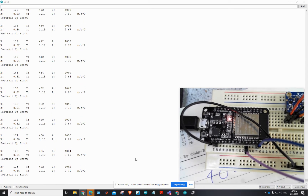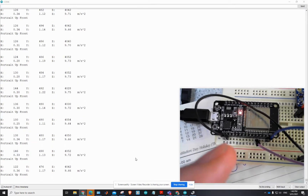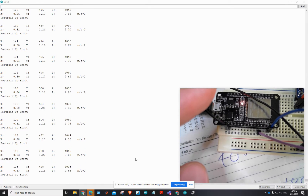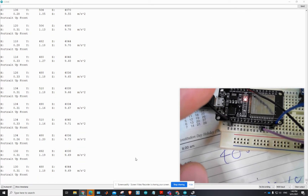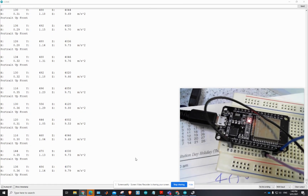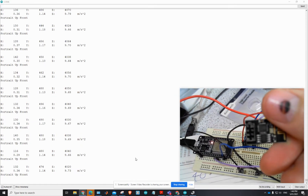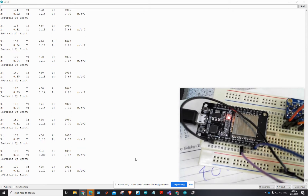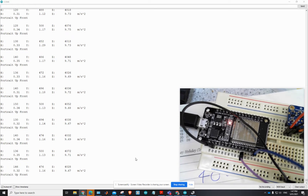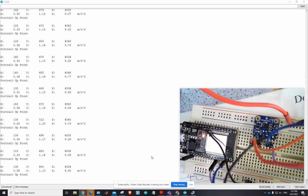It's got good RAM, and it's got your buttons so that when you're installing the firmware you can easily flash it — you hold that one down briefly, then hold the enable button down, let go of boot, then let go of enable. You've got your USB straight there so you don't need a separate programmer like you do with the ESP8266. Look at all the IO you get — it's a truly fantastic board.